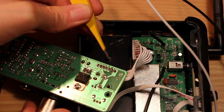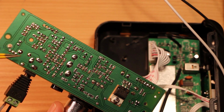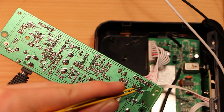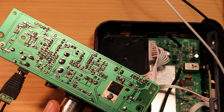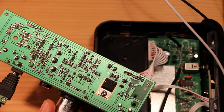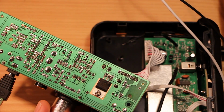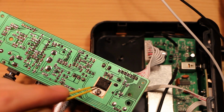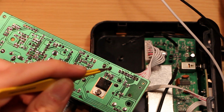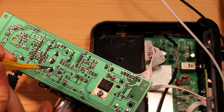These right 3 pins seem to just be for power switching. After the input power goes through the protection diode right behind here, it ends up on this pin 3rd from the end. Then we've got one no connect, and then this pin on the end, I'm guessing is the power coming back to us through the switch, because that heads right to the input of this 7809 9-volt linear regulator.